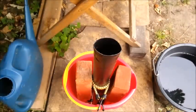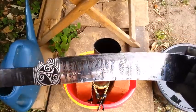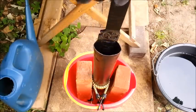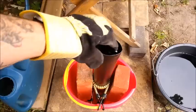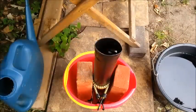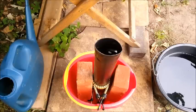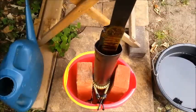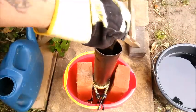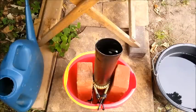Okay, that's the ferric chloride in. Now it's just a case of taking a last look at what it looked like before, and we're just going to drop it straight in the ferric chloride. That's where it will stay for about 45 to 50 minutes. Then I'll take it out and clean off the corrosion scum. If it's etched enough that's fine — if not I might resubmerge it if I'm not happy with how deep the etching has gone. As you can see it's come right up to where I wanted it to on the blade.